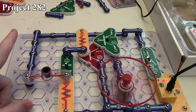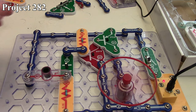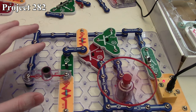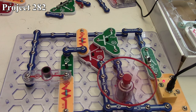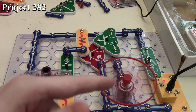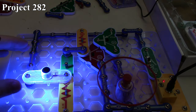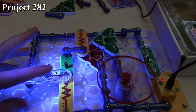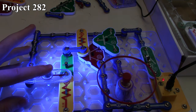What's happening is we're affecting the charge in our C4 capacitor by changing the resistance on our photoresistor, allowing it to pass charge through it or discharge it entirely. By doing that, we affect the current on the base of our NPN transistor, which consequently affects our PNP and ends up affecting how the motor operates. We can do this to a greater extent if we shine a light on there, because we've really changed the dynamics of the capacitor to where the motor completely stops, and we have to let the capacitor recover before the motor can start again.